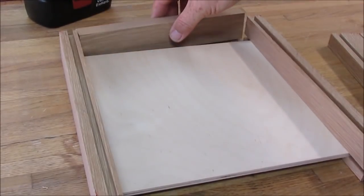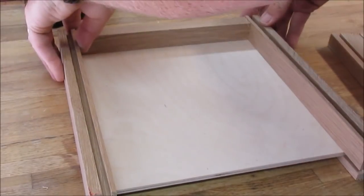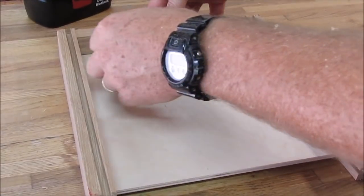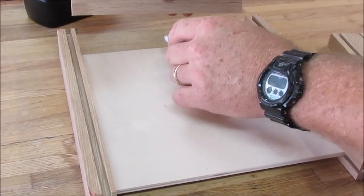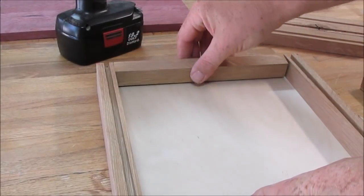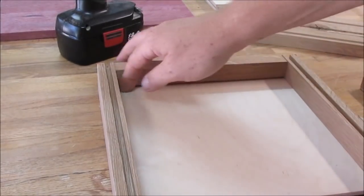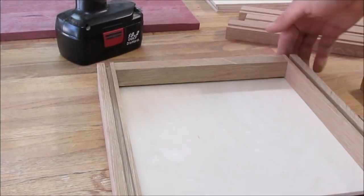So what I want to do is line up the top piece, make sure it's flush on the top and all the way up as far as I want it to be. Then I'm going to draw a pencil line on this side so I know underneath that line is where I want my dado for the top. Now that I've got the four dados in the top cut, let's see if it fits. I cut it a little bit long on the line — that's why that gap's there — but you'll never see that because that's going to be the inside of the box. It fits pretty good and it's flush on the top and the sides.